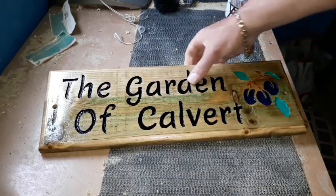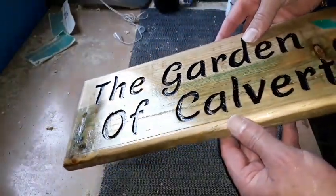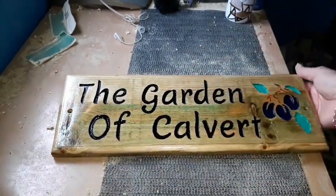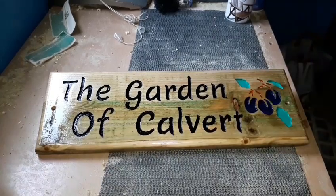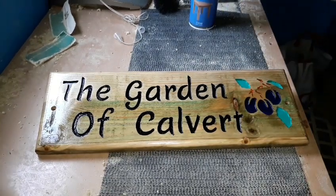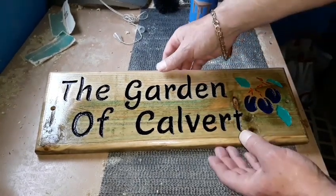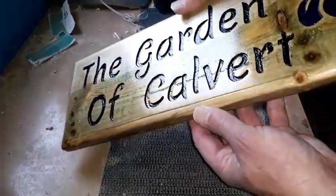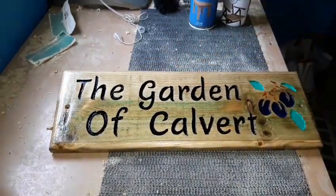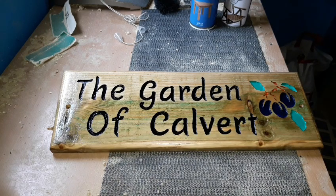You can see from that we're all finished. We've sprayed on our lacquer polyurethane, give it a nice little shine. Remember this is only on scrap wood - fencing boards - so no expense as regards to the materials. I'm not too sure about this polyurethane to be honest - that's a matte finish so I basically went over with some clear lacquer and that's definitely given it a better shine and a better finish, as you can see. And there you have it - one routed out plaque, gate sign, on fence panel wood, 17 inch by 16. Thank you for watching.